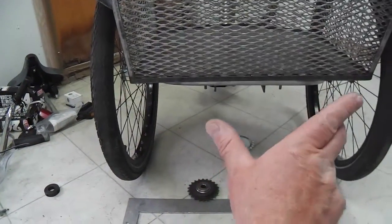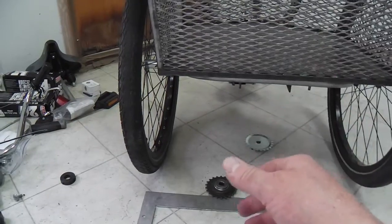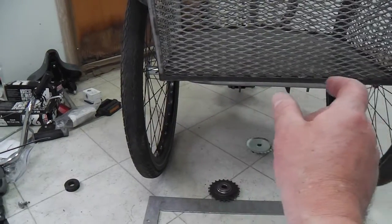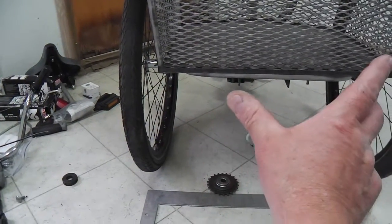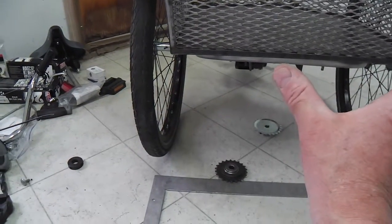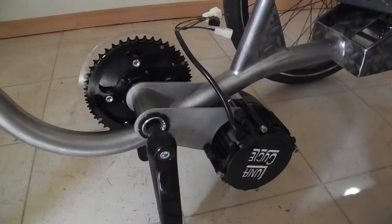Since the motor is driven in this direction, it actually would make more sense to mount it more centered with the gearbox, grab onto this sprocket, and have that one as the output side. And the nice thing is both these are freewheeling. So I'm playing with it and having fun. It is a little more challenging than I thought, but I kind of expected these issues, and sure enough here they are — we're dealing with them. If you get an inherited trike, go ahead and chop off an inch and a half on each side of the tube, bring those axles in, chop them too, put the bearings back in, and you can narrow a trike very easily.